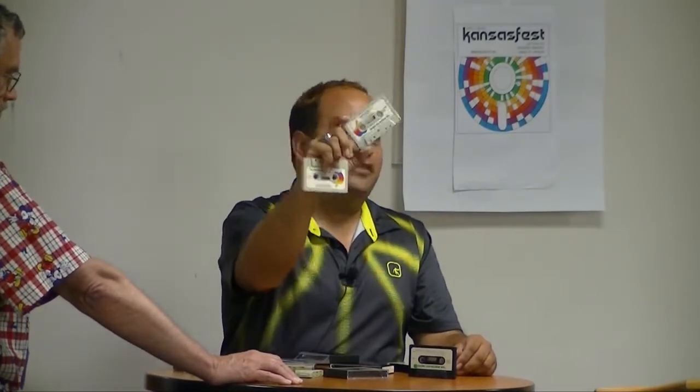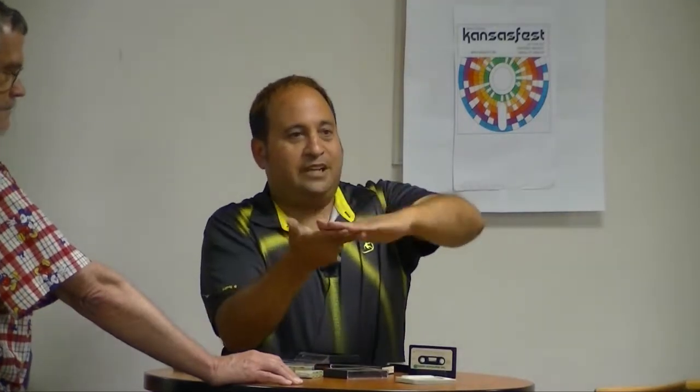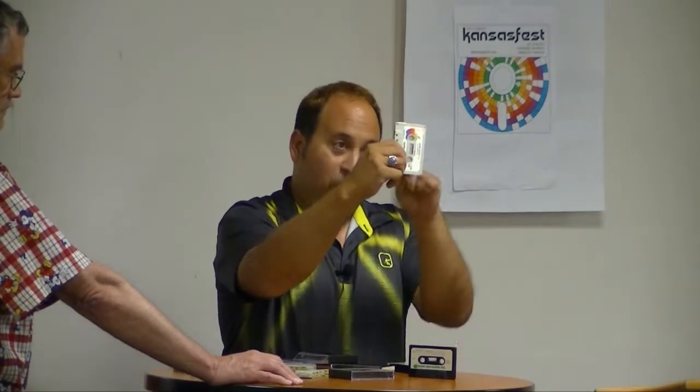Should you want to deal with cassette tapes, first of all, there's probably really no reason to mess with them — you should find the WAV file online, or find the contents online. In fact, the Brutal Deluxe site has done an excellent job of putting together a collection of these. But should you want to, first make sure it sounds right — there isn't enough tape in these things to do anything other than this. Make sure it's nice and loose, the wheels are wiggling in there. If they're not, simply doing this — it's like taking a ring of paper and doing that; that'll fix it. Also, looking in the window, make sure there's no flecks and specs in there. On a VHS machine, you put a tape in there with specs and junk in the window — forget it, the head's gone. It's all jammed in the head. If there's anything in there, just forget it.